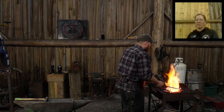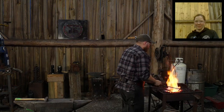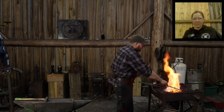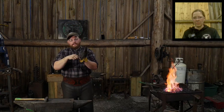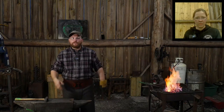Jeff Woodring says, will you use some of the white magical powder or do it without? I'm going to try to do it without. Mainly because, unlike a true bird's mouth weld, in a bird's mouth weld you have a crook at the bottom that can trap junk in it. And without the white magical powder, the flux, it doesn't help drive that scale or debris out of the welded joint. It's a lot easier to get an inclusion at the bottom of your weld. This, there's only just two surfaces. Now, there's a broad surface there, so we'll see how it goes.